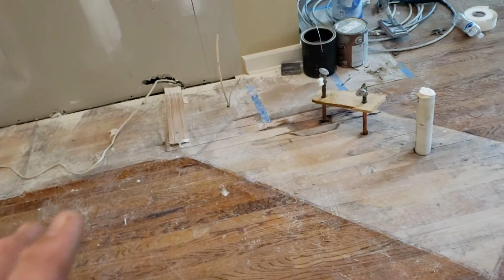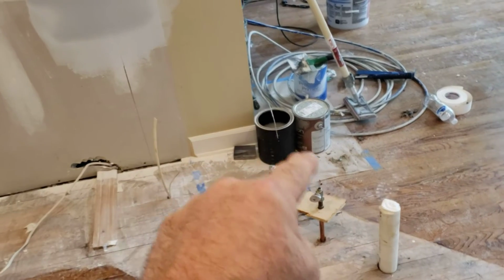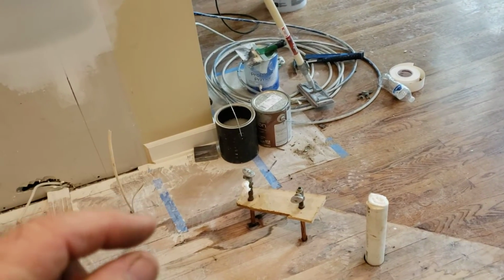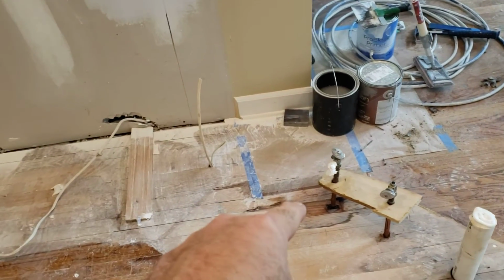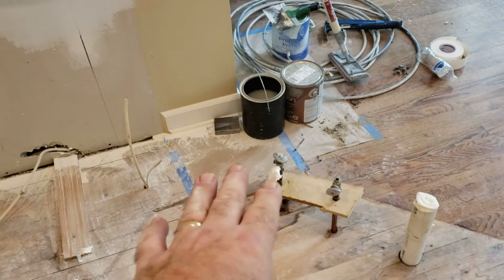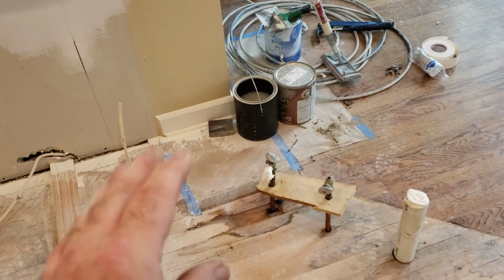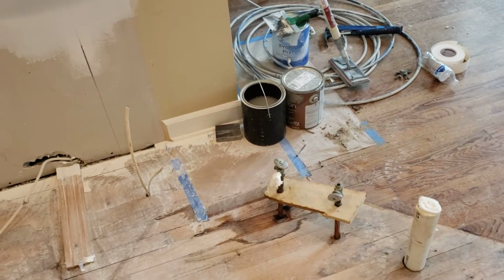But a couple things that I'm looking at here. The first thing, just to remind the customer, these three valves or the three openings need to have some 3/8 inch brass caps with some Teflon tape put on them. There's evidence where you've had a leak right there, but these are 20-year-old valves. The rubber's been sitting in chlorinated water for 20 plus years. In the middle of the night when no one's looking, this thing can pop loose and start spraying water everywhere